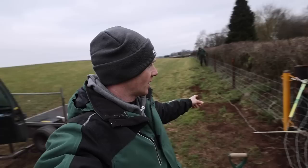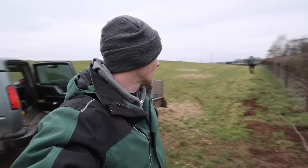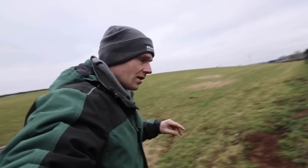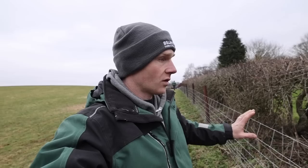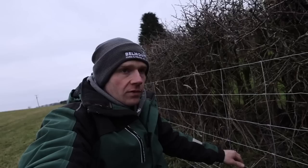So I'll give you a bit of an update on what's going on. The strainers are built at either end now, just straining out the netting — making sure it's not catching at any point all the way along, straining that up, getting it joined, releasing it so it'll all be tight. Then go and put the two strands above it. We're not going to do barbed wire on the other side — we did barbed wire on the bottom to stop the pig going in under, and also barbed wire above the stock fence. Here we're just going to do two plains above with the top one being electric, and that means I can send a permanent electric around the field and hook onto it where I want to split the field up. Also if the goats are trying to get to a hedge and we don't want them to, we can leave it on.